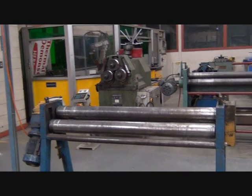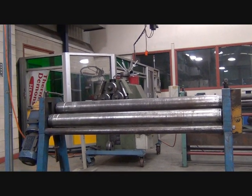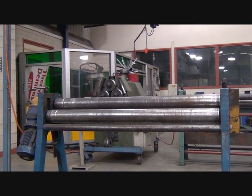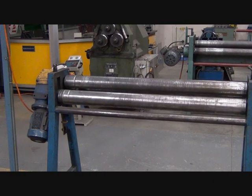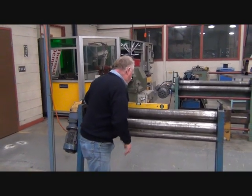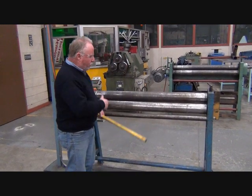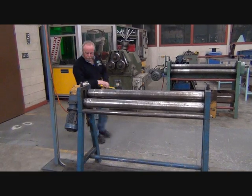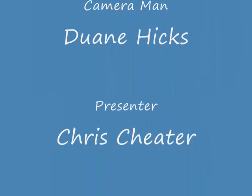I'm going to stand back and look at this roller and compare it to the gap. I'll go up a little bit more there. I think that's pretty good. I'll get a level and put it on the top roller and take note of where the bubble is in the spirit level. It's slightly at that end and exactly the same there. Now I'm going to take those packers out, and the machine's ready to roll.